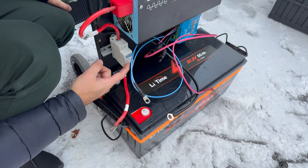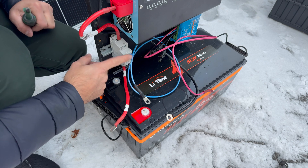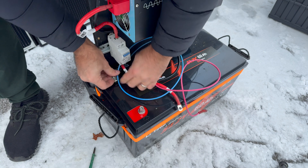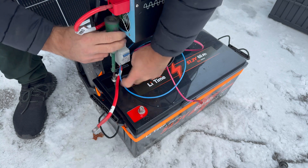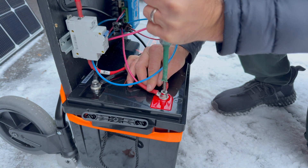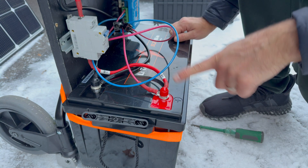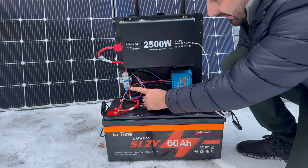Before we start, we make sure the breaker is off. As mentioned, it's upside down, so keep that in mind — you may want to get longer cables to orient it correctly. Using the included M8 bolts, we connect both the negative and positive wires simultaneously. Make sure these are tightened to spec — I'll use a torque wrench to get them to the correct torque. The terminals come with a protective cap for a little extra safety, since this is a 48-volt system and can be dangerous if you're not careful. And that's basically it for the build!